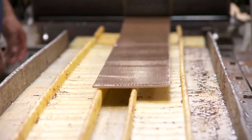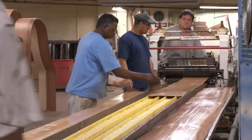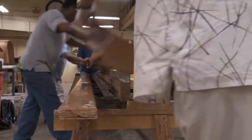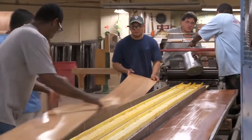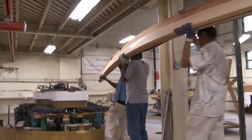Straight-grained hard rock maple is laminated and glued together in flat-grained sets. Flat graining gives a 47% improvement of vibrational characteristics over cross-grained plywood-style sets. Steinway's unique system is to bend both an inner rim and an outer rim at the same time. This is the method that achieves ultimate strength and durability and the quality of sound distinctive to Steinway. The sets of maple, about 20 feet long, are carried to the press and clamped into position.